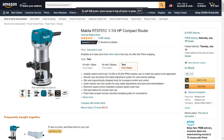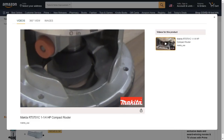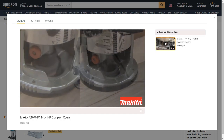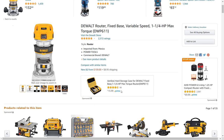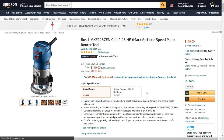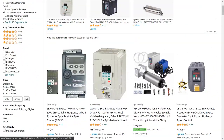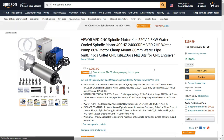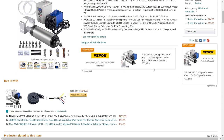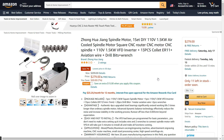The first option is to install a wood router. A Makita 1.25 horsepower router costs around $80. It's quite powerful compared to the stock one, but like all other wood routers, they are super noisy and it's a bit too large for this 3018. The second option is to install a VFD, which stands for variable frequency drive. This device can convert single-phase power to three phases and can handle much more powerful spindles, but it's kind of expensive.